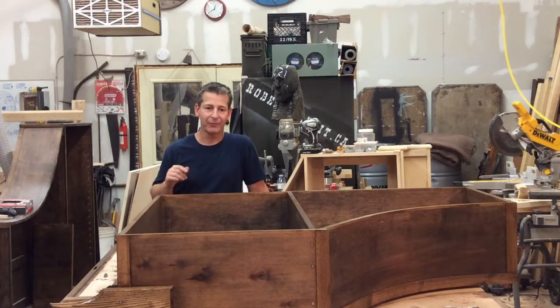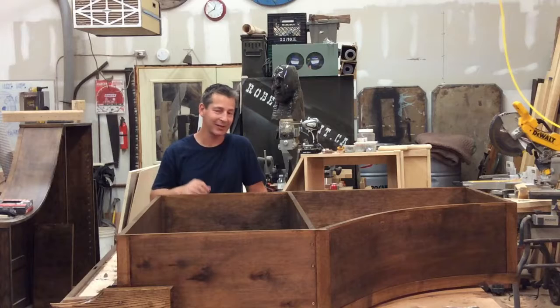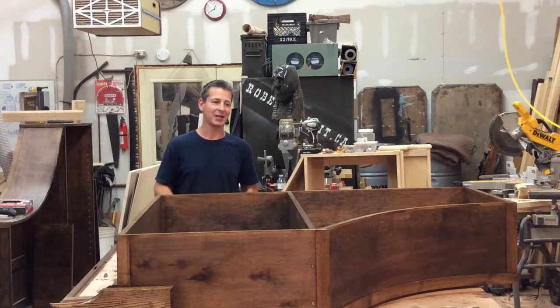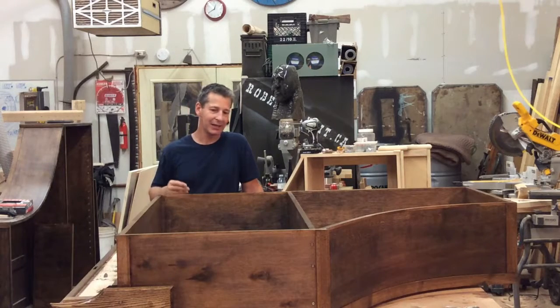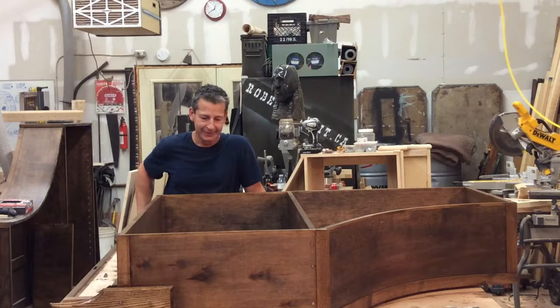However, with this first coat of the high gloss, well, actually they call it a clear gloss, they don't actually call it a high gloss. They have a matte finish, a satin, and a clear gloss. So technically the clear gloss is a high gloss. I'm not very happy with it. Somebody asked me for a high gloss finish. I mean, they want shiny. This is not shiny. Albeit it's the first coat, but I know with standard brush application, polyurethanes and varathanes, on a first coat high gloss, I would be getting a lot of sparkle right off the bat. And you can't see, but if I look in the back here, the back of that looks dull. Doesn't look high gloss, that's for sure.